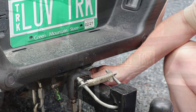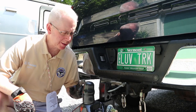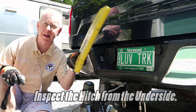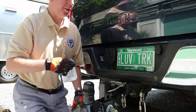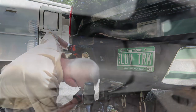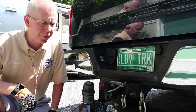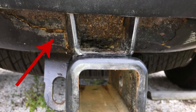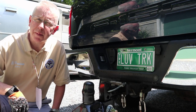As soon as the hitch is installed into the receiver, one of the most important things to do is check the condition of the hitch underneath the truck. I've got my knee pad and my flashlight, and I'm going to go ahead and check underneath, looking for any cracks, any broken welds, anything that doesn't look normal. We've seen this happen with at least three of our friends — and even though ours is a 2018 truck, we still check it out, because you never know when there might be a crack or some type of failure.